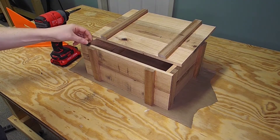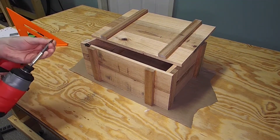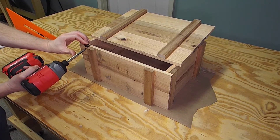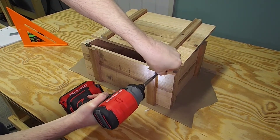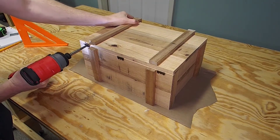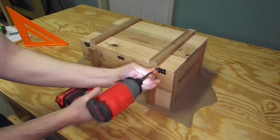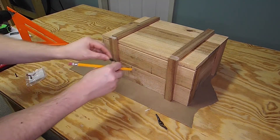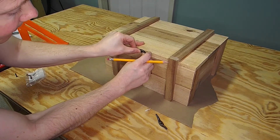We've made it to the hardware. We're going to start with our little butterfly hinges here. Hopefully these screws are small enough that they won't crack this oak — I don't think we'll need pilot holes with these. For a latch on this crate, we're going to use rope cleats, and I'm going to drill pilot holes for these because the screws are a little bit bigger than the hinge screws and I'm afraid they will split this oak.